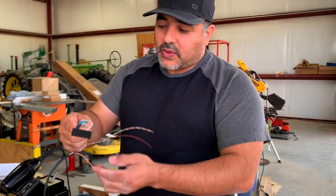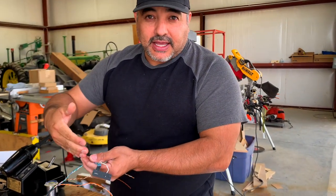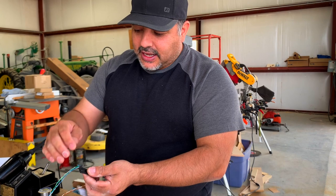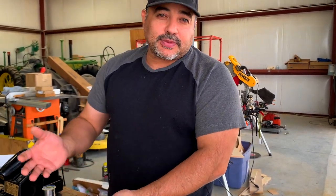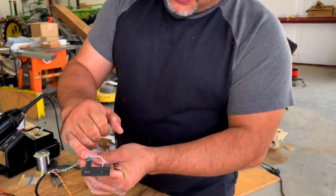Then the wires that are coming off of it, there'll be another wire that feeds 3 volts. So when you close the switch and you make that connection, it'll show high on whatever button you pushed. If it shows high, then it will be a signal like, hey, it's on. We've also written special code so that if you keep it pressed, it will dim the lights until they're at the lowest and then bring them back up. That's a subject for another time, but that's the way we're using them. And so this is the problem we had to overcome.